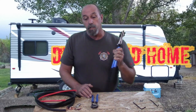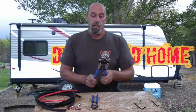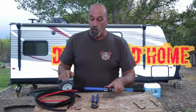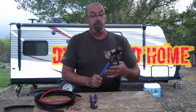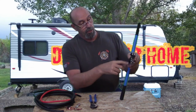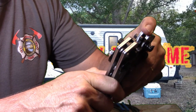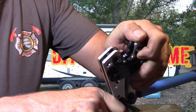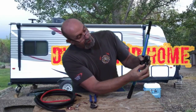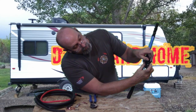This is what they call the IWISS HX50BI Battery Cable Lug Crimper, and it is capable of crimping lugs on wires from 8 gauge all the way up to 1-aught. The way these operate is there are two dies on the head of this unit that are affixed with a center pin that is spring loaded. To change the size of wire you plan on crimping, you just depress the center pin and rotate the die until the number wire gauge size you're looking at is on top. So if I'm going to do 4 gauge wire, I would rotate the die until I see 4 on the top, and do the same on the other die.